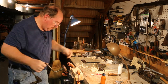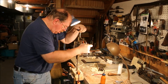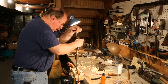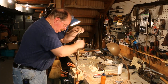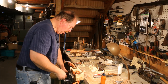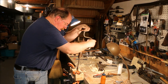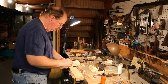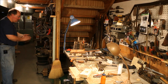I'm having trouble drilling these holes. I get in about an eighth of an inch and it strips the pilot out. Turns out somebody had sharpened this auger bit and really screwed up the angles on it so that the center cutter was just rubbing instead of cutting. I could get about a quarter inch in and then it would just pop out. So as time went on, I'm doing a lot of sharpening and adjusting and tweaking on this drill bit. The center radial cutter needed to be sharpened, the pilot thread needed to be cleaned, the angle needed to be fixed on the center pilot, and I needed to sharpen the wing cutter also. By the time I was all finished with those things, I ended up with this little plug cut out of there and I was extremely sweaty.